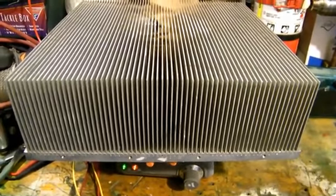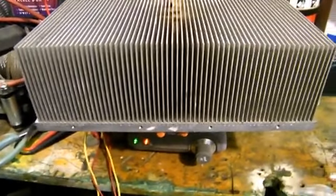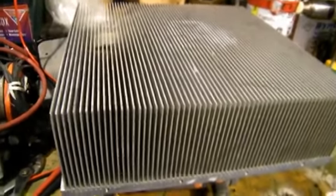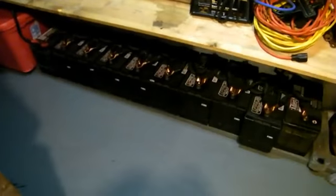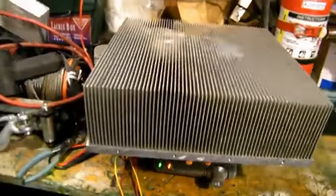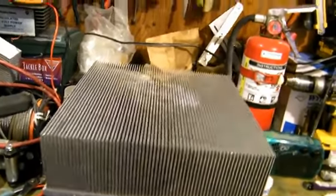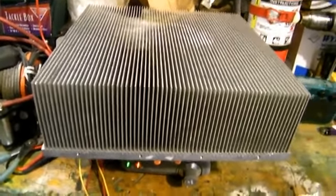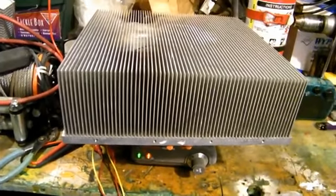So each cooler puts out something like a volt and a half, and I figured, well, if you could stack like a dozen of these on top of each other and get up like 16 volts, and have one side on my wood stove and one side facing the outside of the house to the winter weather, and if you ran that through maybe a $20 charge controller off eBay, a real simple 10 amp something or other, you could in turn charge the battery bank up. And I figured, well, hey, if you can generate 3, 4, 5 amps at the most, if you stack these things right on top of each other, and the heat just goes through each one of them, and that's where you get your juice, as long as you have the temperature differential on each side. But if you could stack these, that'd be like having a solar panel going 24 hours a day, 7 days a week, because we always keep our wood stove going because that's our primary heat source in the wintertime.